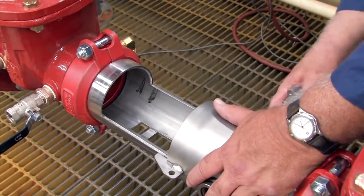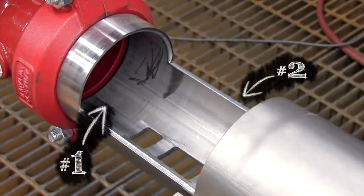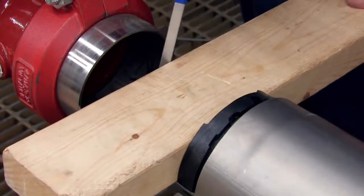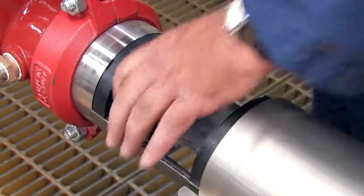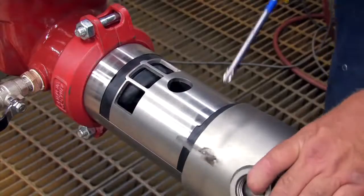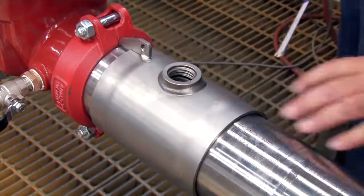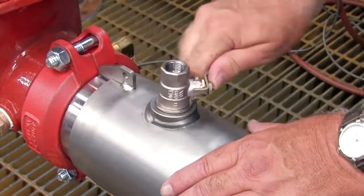Re-attach the relief valve to the bottom of the cover sleeve by hand, being careful not to over-tighten. When rebuilding the assembly, the number 2 check should be replaced first, followed by the number 1. If either check cannot be reinstalled by hand, place a small piece of 2x4 against the check body and gently apply pressure to slide it into place. Thorough lubrication of the O-rings with an FDA approved lubricant will help during reinstallation. With the checks replaced, reinstall the stainless steel retainer plate and slowly close the cover sleeve, using a number 3 Phillips head screwdriver as a handle. Re-install the number 3 test cock hand tight and finish rebuilding the unit by re-attaching the relief valve sensing line with a wrench.